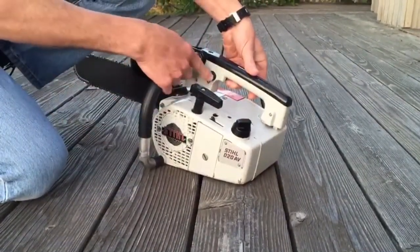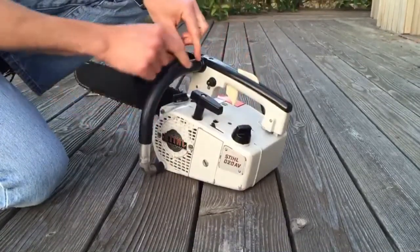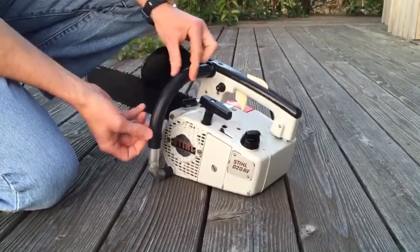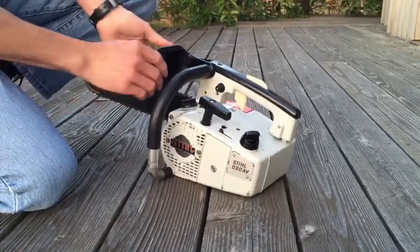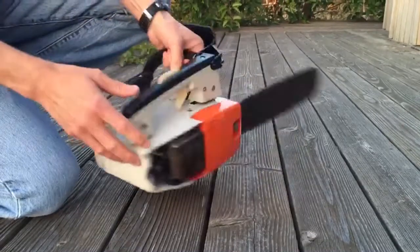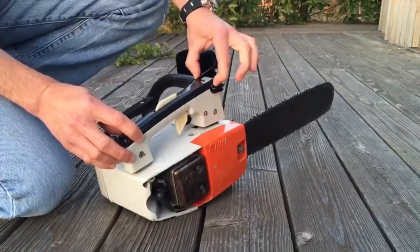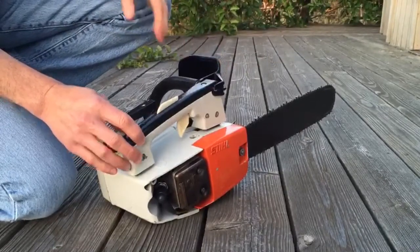The safety assembly works as it should. The bar originally had a cut in it — I cut that out and slid the two pieces together, so it looks really nice. This piece of plastic was originally flopping and loose. I used a heat gun to shrink the angle where it attaches, then set it under cold water, so now it fits much nicer.